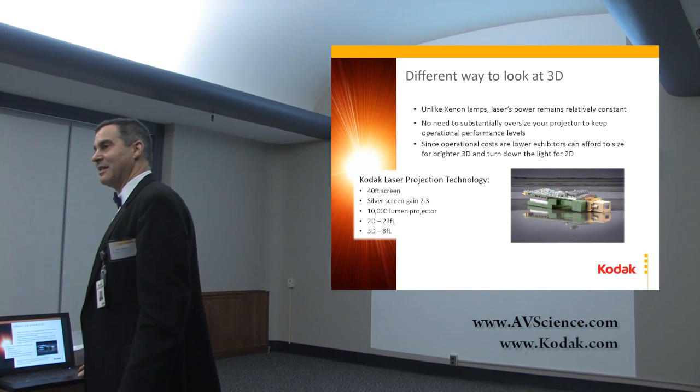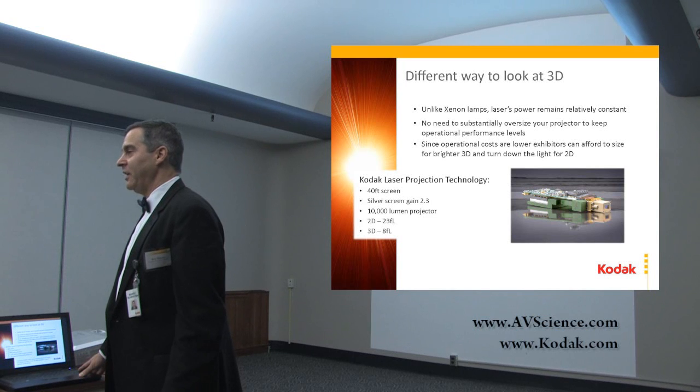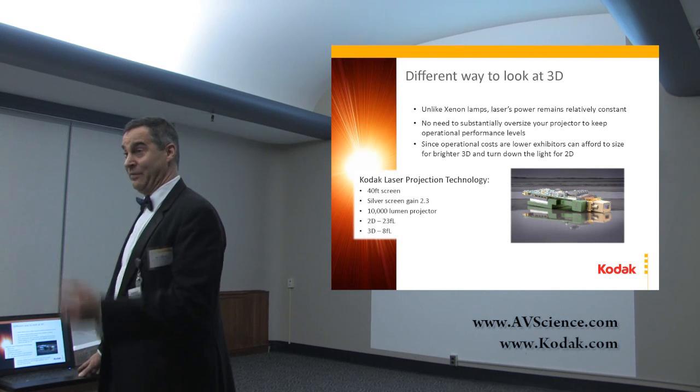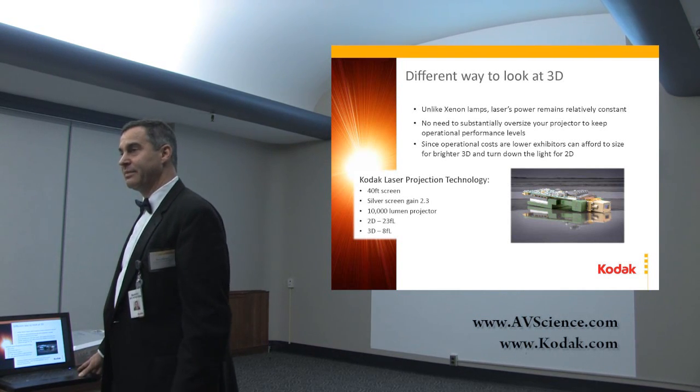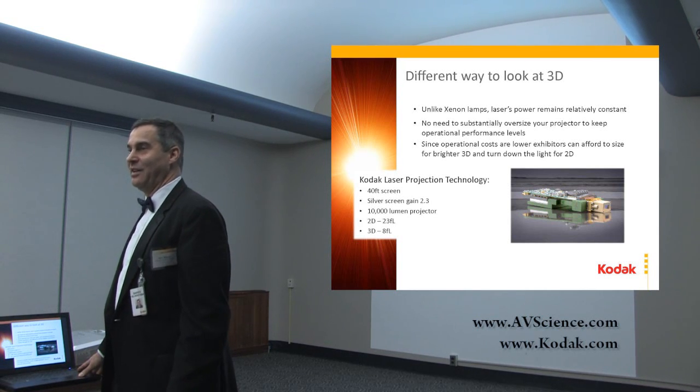We have content that is both 2D and 3D, so you'll see the 2D projection at 14 foot-lamberts and can remember that when watching the 3D version of the same movie. We also have content graded at 4.3 or 5 foot-lamberts and content graded at 8 foot-lamberts — what you can actually see in the brighter picture is substantially better, and it really helps the 3D effect. The dark time for the flip of triple flash uses the same exact electronics straight out of a DCI projector.